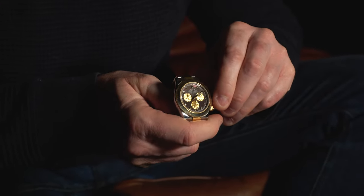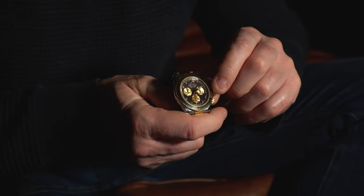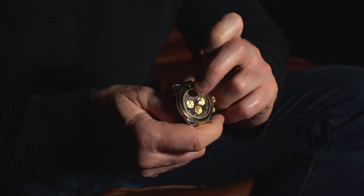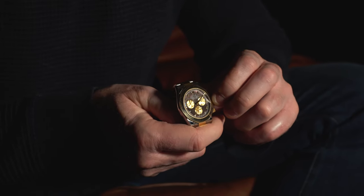You unscrew the crown to the first movement — excuse me, I'm being a bit cack-handed here because I'm right-handed. You'd wind it manually using the normal winder, and then pull the crown out to its first stage to set the time. When you pull the crown out, it has hacking, so it will stop the second hand. You wait until the second hand hits the 12 o'clock position, pull the crown to stop it, set the minutes and hour hand, then push the crown back in to release the hack and start the second hand again.